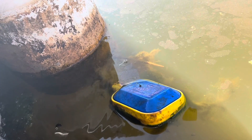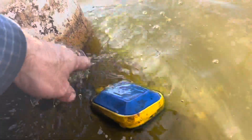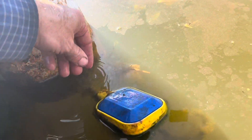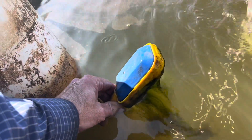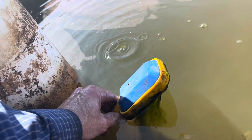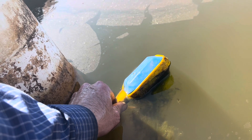The good thing about this style of float switch is that if there's a bit of wind and a ripple in the water, the pump won't just turn on and off all day — because if that happens it wears your pump out quicker. It's got a range to it: it has to go all the way down to turn on, then all the way back up to turn off. That way if the pump turns on, it's probably going to run for at least half an hour and not just stop and start all day.